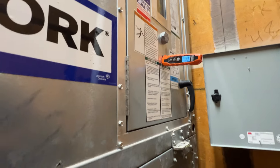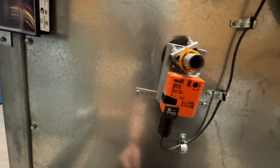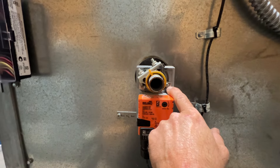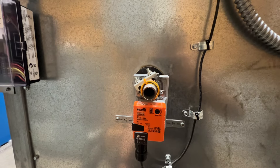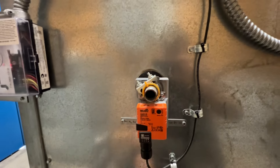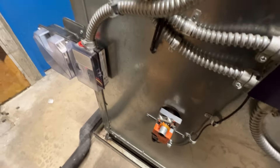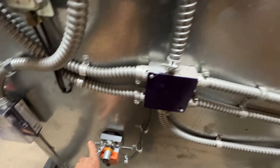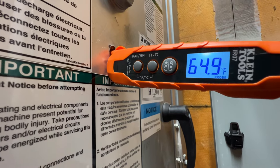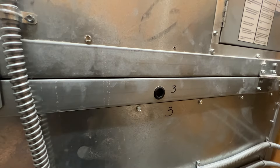I may do just a little fine tuning on these dampers. I also want to check when it does lock to make sure it comes back. I did adjust the stop up a little bit because I think it might have been just going too far and binding up. There's still a possibility this actuator is getting weak, but I think it's just an adjustment right now. I loosened that actuator and gave it a little knock — tighten it back down. The supply is now dropping more, so this should start to regulate and keep us at that 72 degrees.